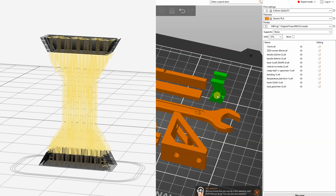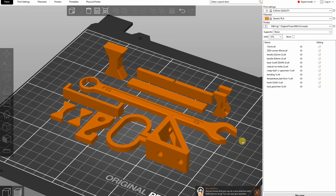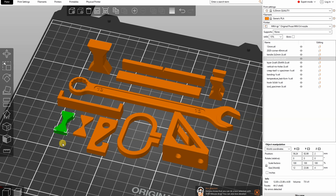The others are my regular test objects for the creep test, hook test, tensile test, bending, and impact test. For the layer adhesion specimens, they told me the smallest cross-section area is too small for fiber reinforcing and the fibers don't help anyway. I told them I know, but I'm curious how much weaker the cross-section will be — print them without fibers. I also sent a bigger one with a 10 by 10 millimeter smallest cross-section area. I didn't get any reply, and unfortunately only four types of test objects were printed for me.